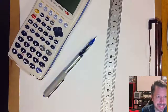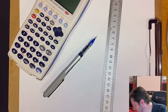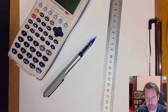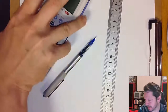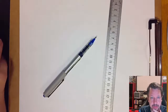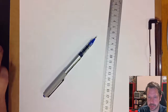Today we're going to look at chapter 10, section 10.9 in Shigley's: fatigue loading of helical compression springs. We're still looking at compression springs that are helical — round helix shape — but now we're looking at fatigue loading. So you load them over and over again and ask: do they eventually fail or not? We'll go back to valve springs in a car because they're good compression springs to examine.